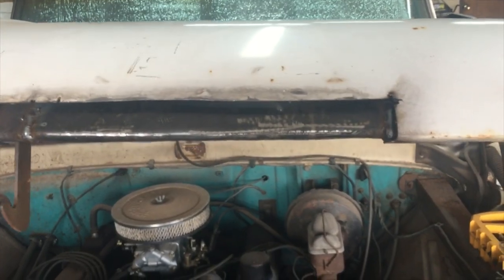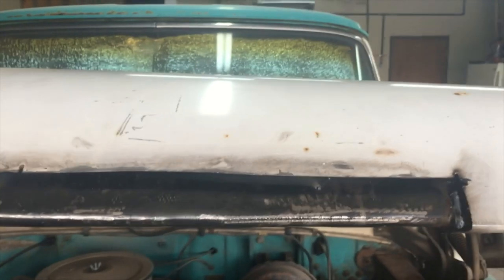I've got this fitting pretty good in there. I'll take and tack it across the top, then kind of weld it down, and fit the lip once I get it welded down to that point. That'll give me a nice square edge. So I'm going to go ahead and get my welder and put a few tacks in it. That's the inner piece welded in — just remember that's the inner piece across there and in there. I haven't ground it yet, but that's fixing the inner part of the hood. Got a little bit more shaping to do to get it just right, but that's nice — I'm liking it.